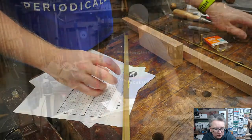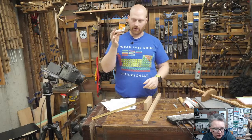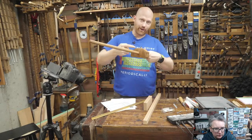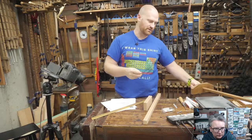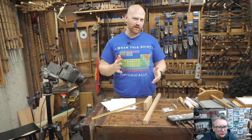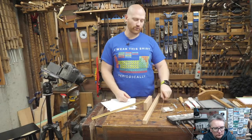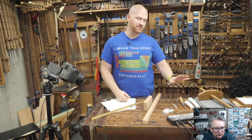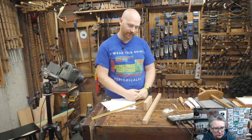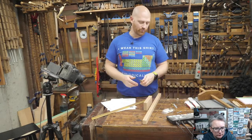I'm going to use some half inch brass screws to hold this on — you can just glue it — and a thumb screw going down into the top. I find the thumb screw a little bit faster and easier than a wedge. As for tools, you're going to need a little bit of epoxy; I'm using five minute epoxy so I can do it live rather than waiting a day and a half for the glue to set. You'll also need the standard assortment of planes, chisels, and saws.